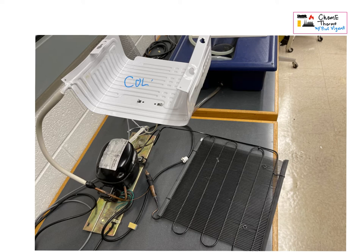This is the cold heat exchanger — that's the evaporator — and it's at low pressure. Stuff comes in here as a liquid and exits as a vapor. Let's follow that vapor: it goes down the pipe and into the compressor, which increases its pressure. So the compressor takes in vapor and increases the pressure.